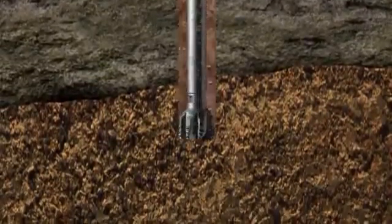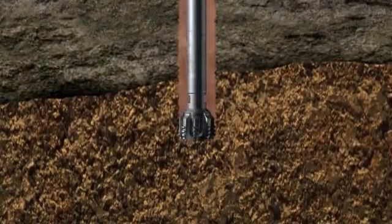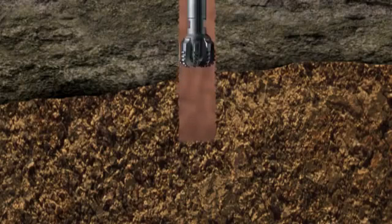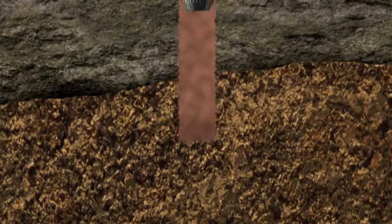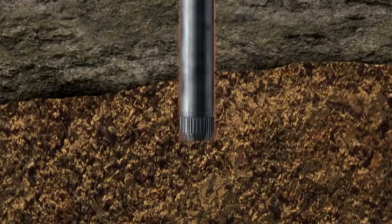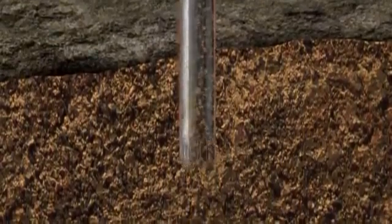When the well penetrates a potential reservoir rock, the oil or gas may be detected by analyzing the drilling cuttings for traces of gas and or oil. At this stage, it is essential to gather as much information as possible about the reservoir. Two methods provide most of the information. In the first, the drill bit is replaced with a diamond-studded coring bit at the bottom of a core barrel. This can cut a complete section of the reservoir rock and return it to surface for detailed analysis.